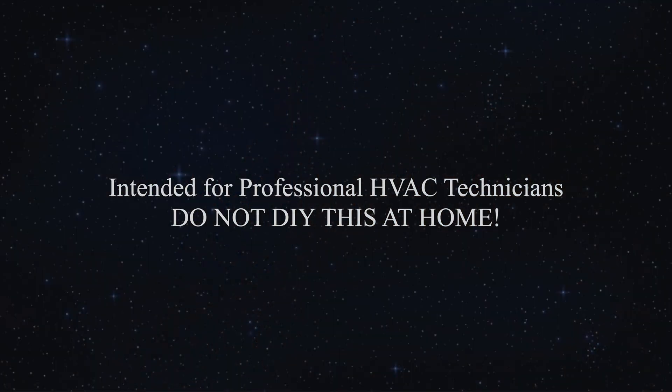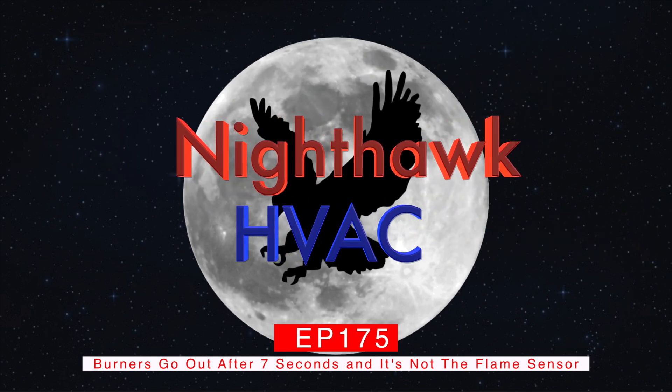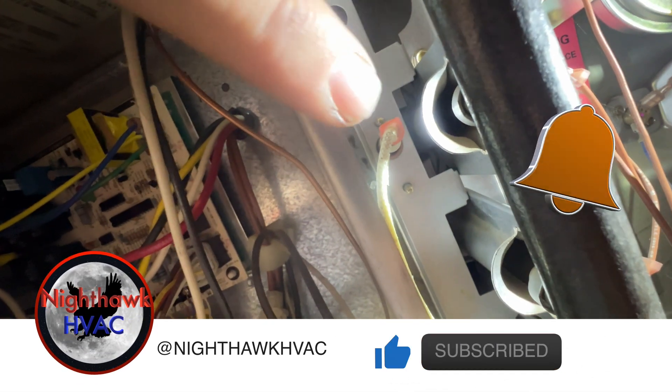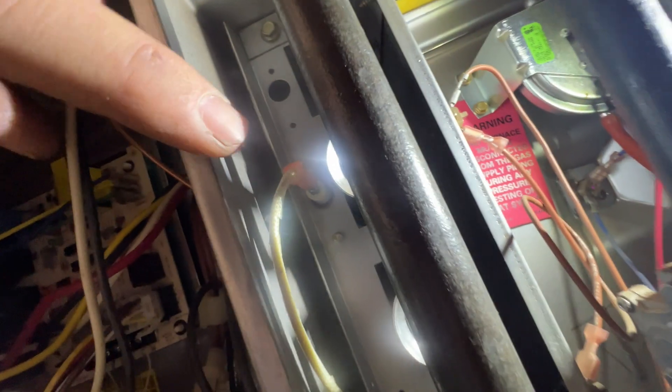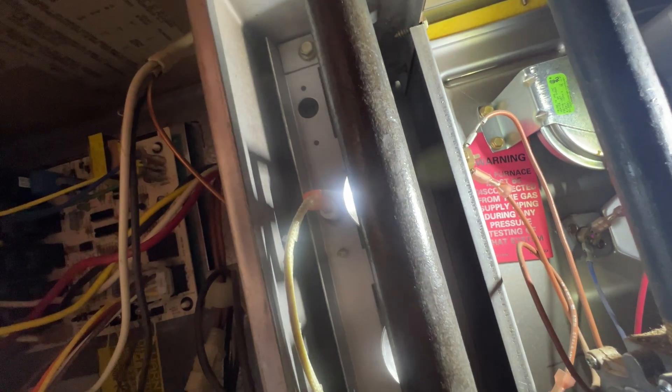So there's our flame sensor. It's probably never been cleaned. The screws are sticking out. In order to take the flame sensor out, you have to take the entire burner assembly out. This is a stupid design by Lennox from their old units — they did it where you had to screw it in from the other side. So I literally have to take this entire burner assembly apart just to clean the flame sensor. I can almost guarantee nobody's cleaned this thing.